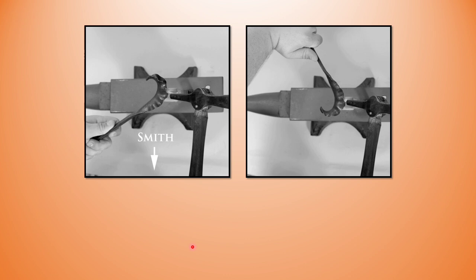There are two positions for the smith: you're going to have your tong hand bent, or you're going to have your tong hand straight to work on the other side. If you're not in either of those two positions, you need to reposition.